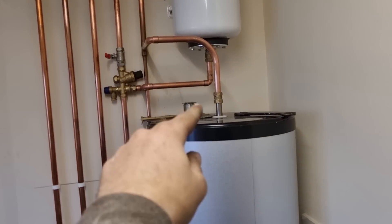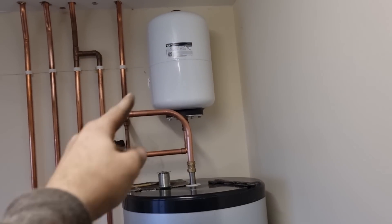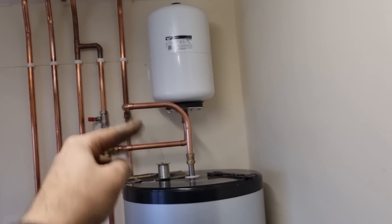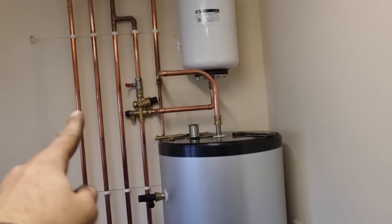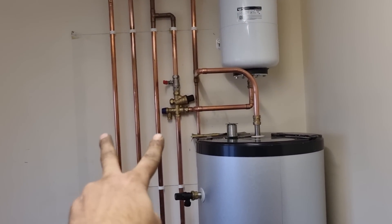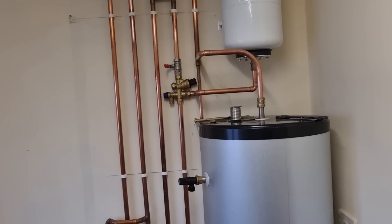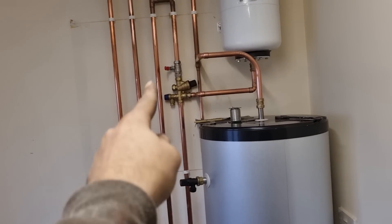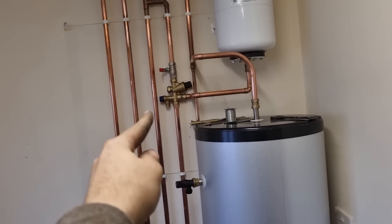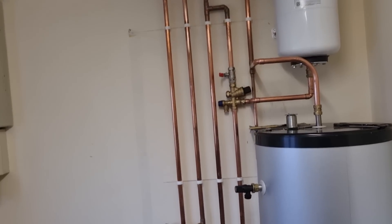The expansion vessel is piped in — looks neat. To drain it, just turn the water off, open the hot tap, and pump it out of the cylinder. Next is the heating vessel. I'll cut the fill loop in so it hangs round — double check valve on the cold side and the heating side. That fill loop is in now. There's a random drain-off tap in there because I had the wrong pipe, but you can drain the upstairs heating into the condense, and drain through there too.